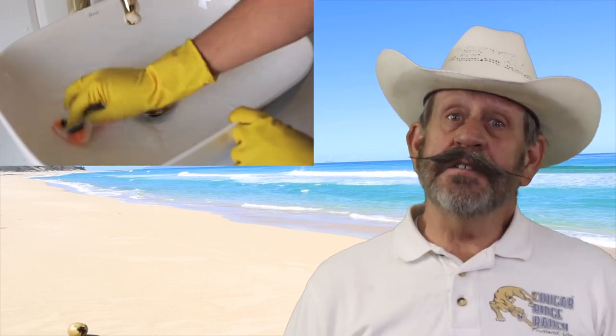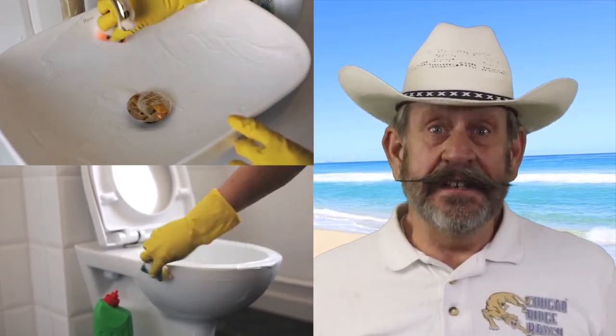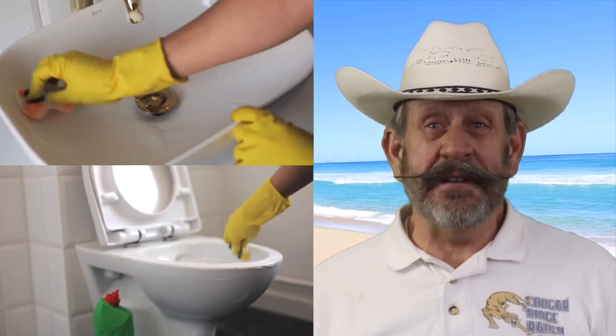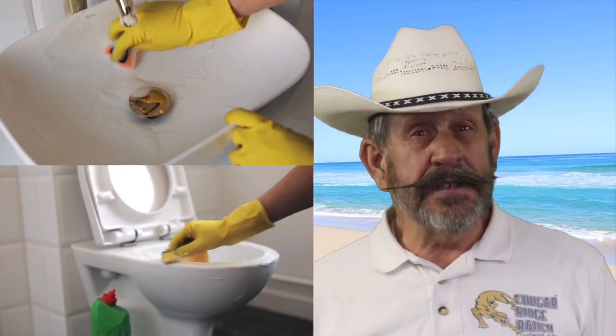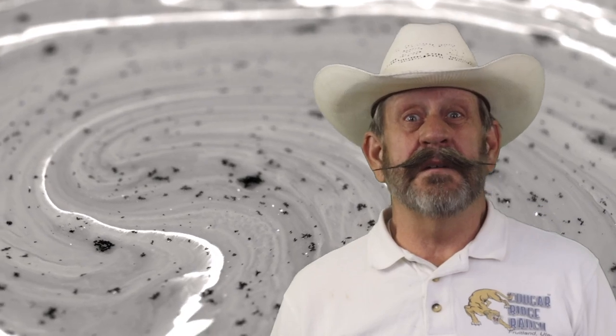So, septic tanks and cesspools operate on the principle of bacteria digesting and liquefying the stuff that gets flushed down. But there's a caveat here. When you clean your sinks and your showers and your toilets with chlorine bleach and other bacteria-killing chemicals, hey, it's a good practice for cleanliness and hygiene, but these chemicals also kill the bacteria in your septic tank or cesspool. And once that happens, the stuff that you flush is not getting broken down and liquefied, and your leach lines could plug up. And if that backs up into your septic tank or your cesspool, then you start noticing some really disgusting and nasty stuff backing up in your tubs, showers, toilets, and sinks. For me, it's easier just having the peace of mind that I'm always putting new bacteria and fortifying enzymes in, so the backup problem will not occur at my house.